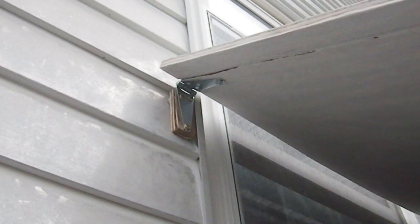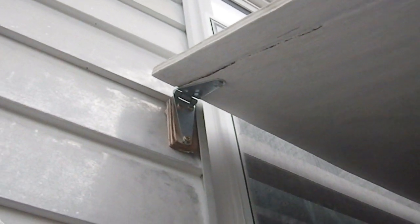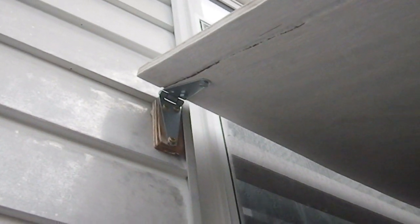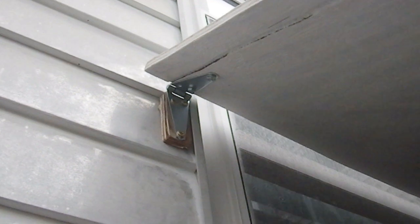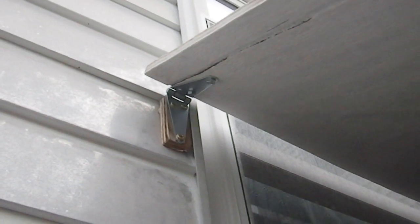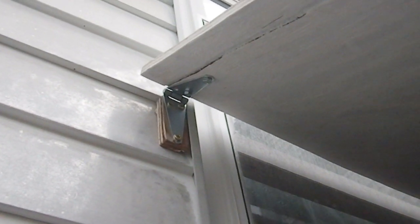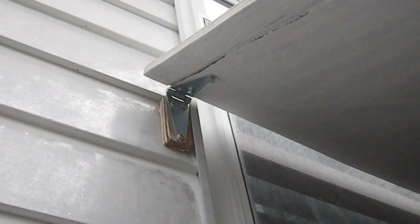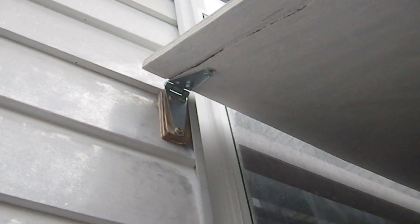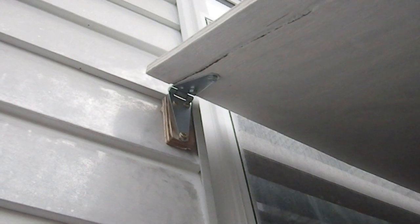It's kind of annoying. So what I used here were 4.5-inch Spax screws. That's S-P-A-X. And they are a Star Drive or Torx head screw. This model here, the large one, uses a T30, which is a very big bit. And they actually have a little bit of a depression at the bottom, which is reflected in the bit, so the bit actually lines itself up really nicely at the bottom. It's proprietary, but you'd be able to use any kind of a T30 star bit in there if you can get your hands on one. They're not common. T30 is not a common size.